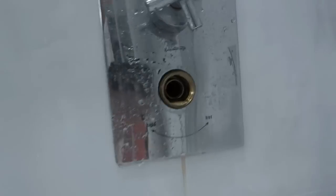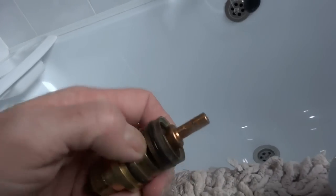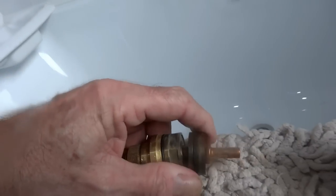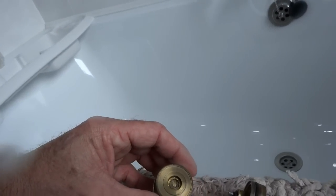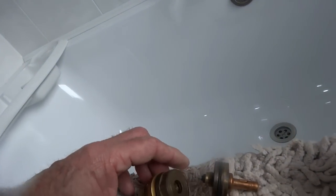Anyway, I've got the valve out now. Getting back to that — you can see our housing set in the wall, and I've taken that out. Here it is, and this should be a sensor on there for the thermostat — and it's broken. There's the problem. That should be attached to that — it's part of the thermostat, but it had to stop it getting too hot when you use the shower. Anyway, it's broke, so I need a complete new part. I've just checked online — it's about £80.